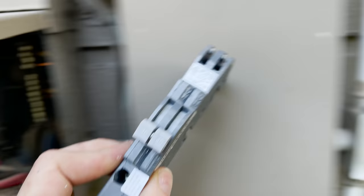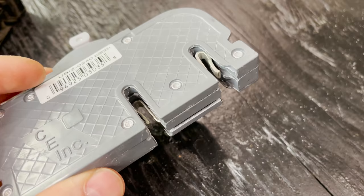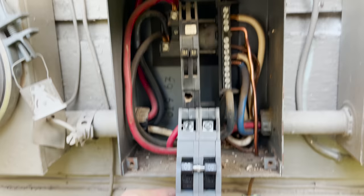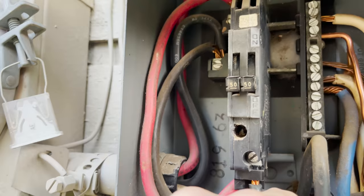It looked decrepit — all worn on the bottom. Connecticut Electric makes brand-new replacement breakers, so if you're ever in this situation, don't use old stuff you're ripping out of other houses. A lot of electricians hang on to rare old breakers for when they're out in the middle of nowhere and need one, but they actually make brand-new ones. I didn't want to put something old and shitty in and have her keep having problems. She had a two-pole 50 — skinny style — I got a fat two-pole 50 from Home Depot, either one works. You can also go to bigelectricsupply.com — there's a link in the description with code 'electrician' for a discount.